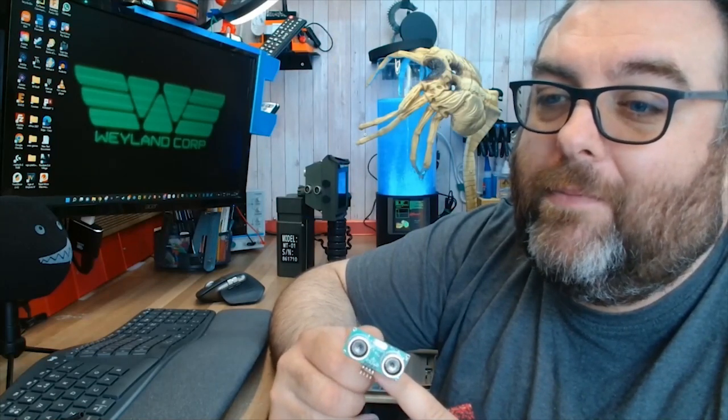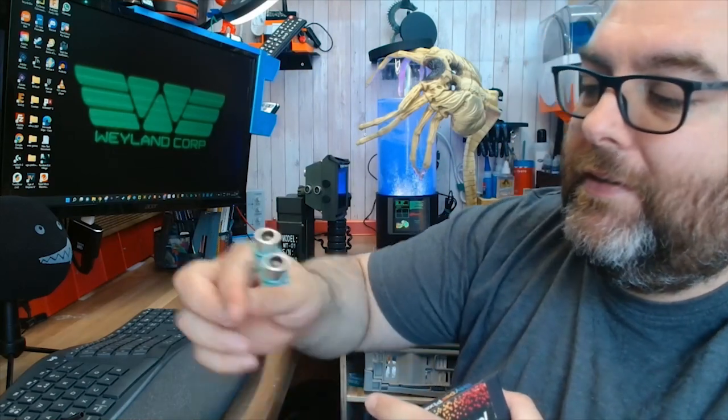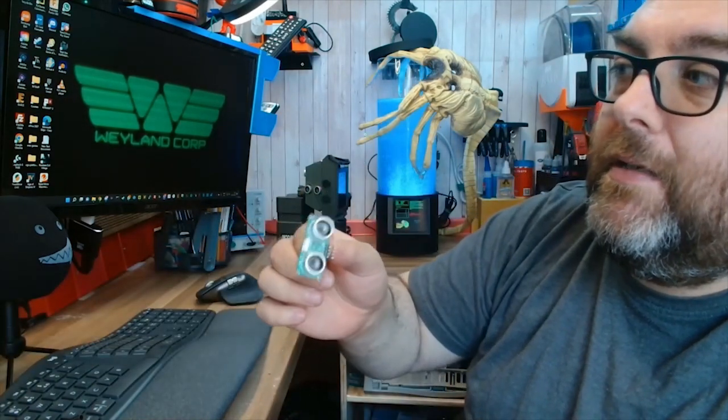Now that could be just down to my coding — I'm not a very good coder, all my code is available through links below, and I'm a very linear, self-taught coder. In the end I found that Waveshare do a screen the same size as the HyperPixel, and it releases the I2C bus. The Waveshare screen, which is linked in the documentation below, uses an HDMI lead to connect to the Raspberry Pi. What this means is you can then use your GPIO pins to connect straight up to these sensors and avoid any timing issues.